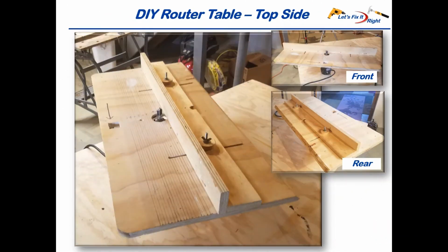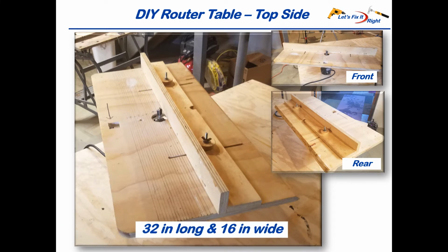As you can see on the top, he provided a plywood fence with these carriage bolts for adjustments. For quick positioning, he added these pre-measured reference lines. Countersunk screws attaching to the router below are located here and underneath the fence here. Lastly, he added this hole for easy carrying. Altogether, the table is 32 inches long and 16 inches wide.